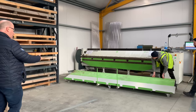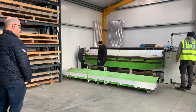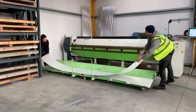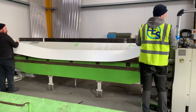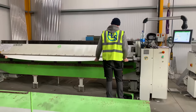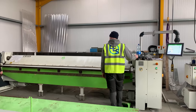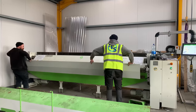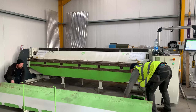It takes over quite a bit because a few 26-gauge of them can be quite heavy — there's a lot of handling on them. So this is creating the angle then? Yes. He's setting the machine up now — you can set the angle to whatever the machine folds, whatever angle you want. And it tells you which fold to do first; it does all that itself. Because the sequence of folds has to be done right — if you fold it wrong, you wouldn't be able to do the last fold, depending on the shape.